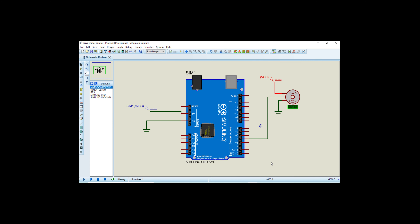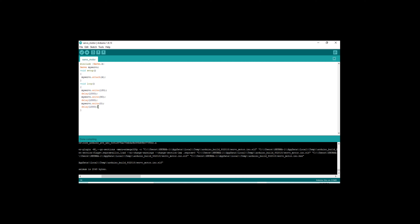Here you can see the continuous running area of the code. I set servo.write(180), so the motor blade moves to 180 degrees. After a one-second delay, the motor moves to 90 degrees. After another delay, the motor rotates to zero degrees. Another delay is declared, and this process repeats continuously. That finishes our code.